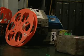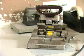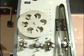Once a film comes from the distributor, it comes on 2,000-foot reels in cases. I take those reels and I build them up, which means I join them together by splicing the film together. Put them on 6,000-foot reels, and usually two 6,000-foot reels is good for a movie. There's one changeover in between, so I run one 6,000-foot reel, and when that's just about over, I have to switch to the other one right in the middle of the movie without the audience knowing.